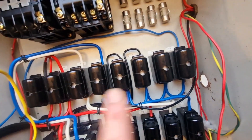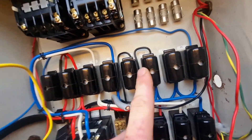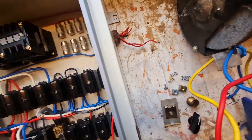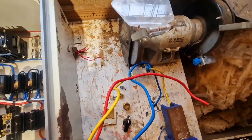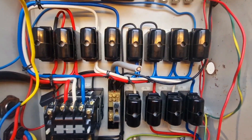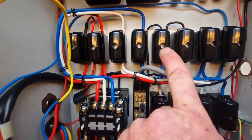F7 is marked up on the plan as push button, and if we follow the cabling through the connector blocks it actually comes out in these cut-off cables here. I think the test button was a separate unit to this panel. The Post Office equipment, or the WB1400, would also have come through there - we'll have a look at that a bit later. F8 next to it is marked up as PO equipment, so that's for the remote control start.